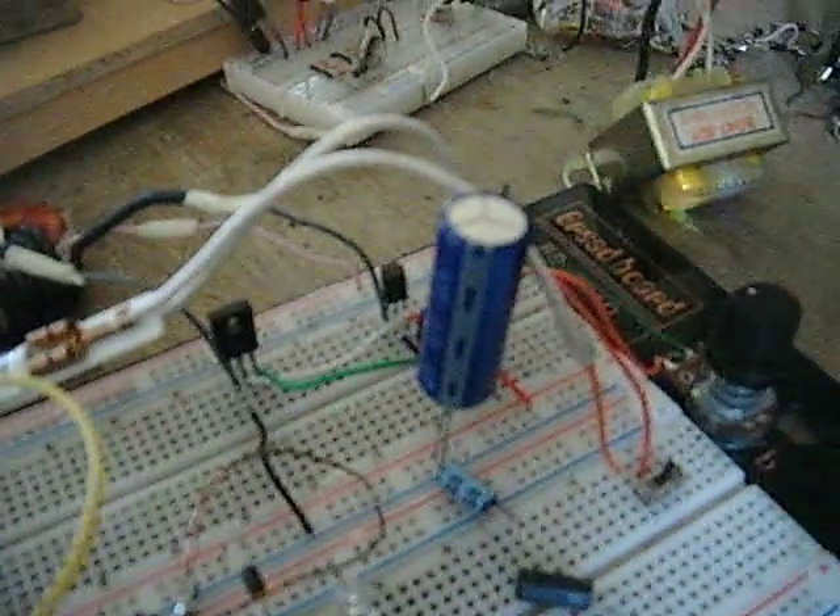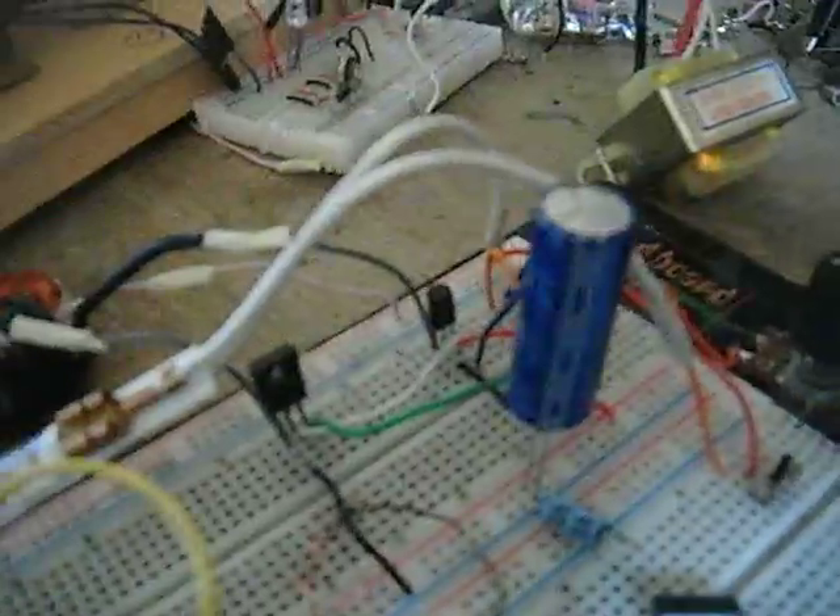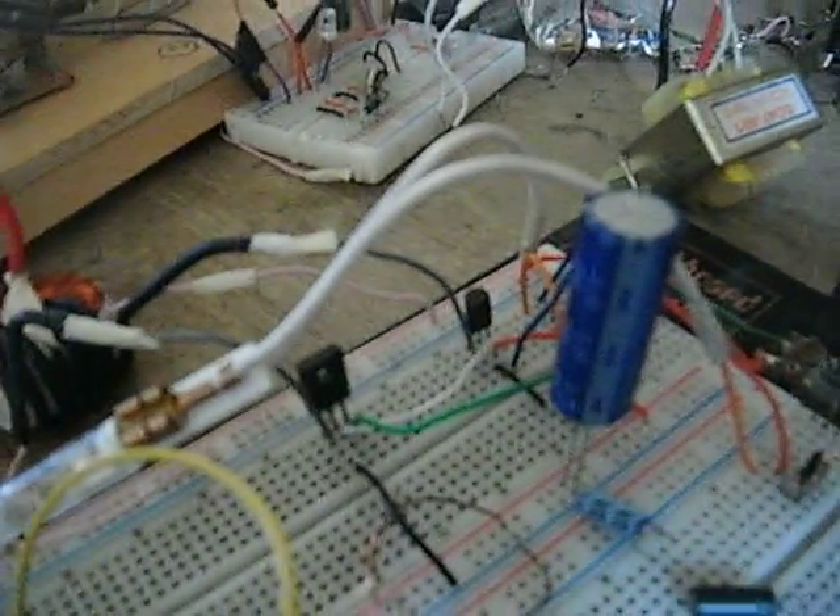Another thing with the toroid - when I added it, I was touching the terminals and it doesn't really give you a shock. It's actually quite smooth, about 90 volts, but I couldn't really feel anything. But with that thing on there it was really spiky, really shocking. I found that quite interesting. The super capacitor in line kept blowing the transistors and I don't know why.